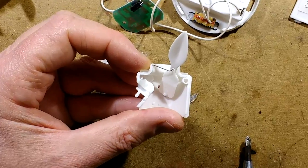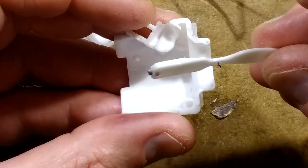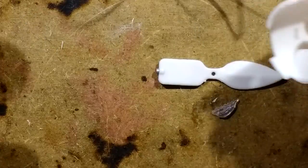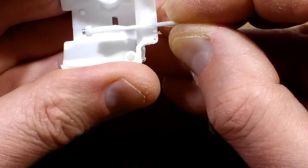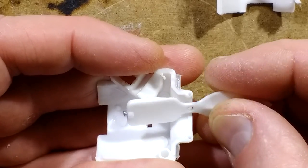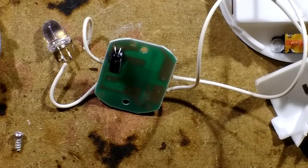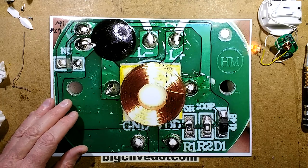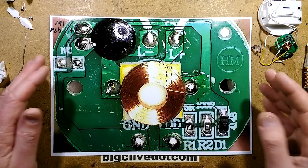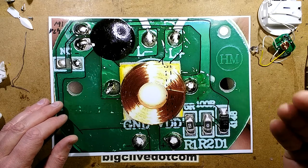It's a little bit of wire designed to provide freedom of movement. Because it's tapered back, it's got a dip further back from the LED - it means that the flame will automatically center on that point, at just the right focal distance from the LED as it moves about. I shall go and take a picture of the circuit board and then we'll reverse engineer it. Here is an image of the circuit board - it makes it much easier to follow. I've also jumpered the connection from the LED so we can see how the coil is being pulsed - it's just a regular repeat pulse.